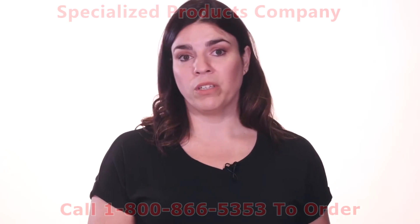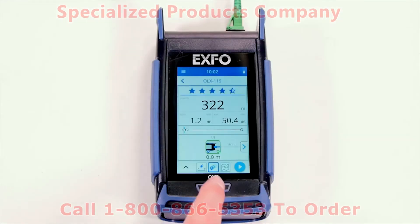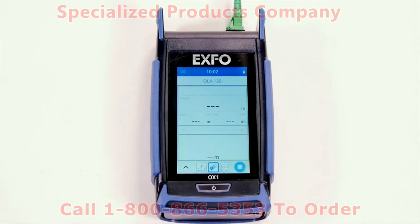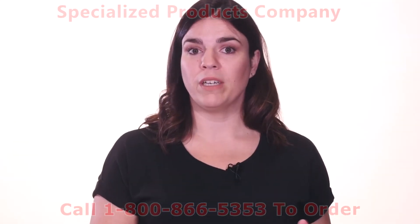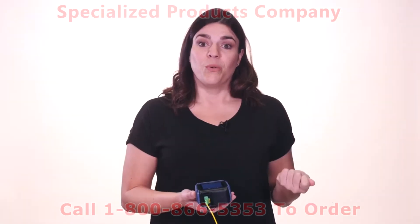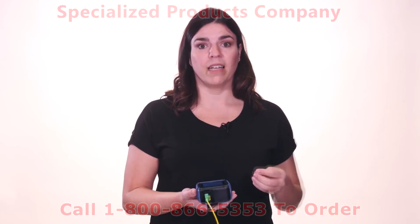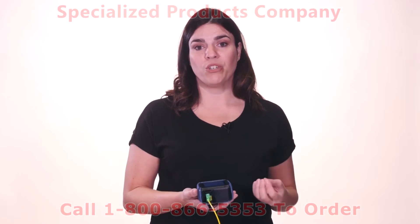It allows you to fully leverage the presence of techs on site while eliminating cost and delays associated with dispatching experts and truck rolls. For example, a technician can run a power check test. If power is low, switch to Fault Explorer mode, find a faulty event, and solve the problem on the spot without escalation. Then the tech can leave the site, assured that the link is ready for seamless acceptance, activation or service recovery. So when an OTDR trace is needed for acceptance, the expert technician comes, shoots the trace and can close more jobs in one day.